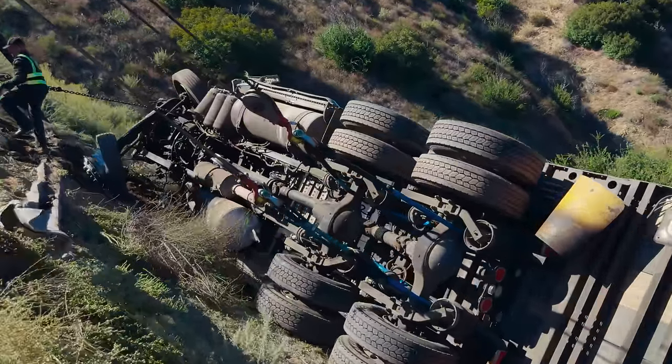So what you're gonna do, since you're fully boomed in, is I'm gonna extend out the boom all the way. Can you extend it out? All the way. See, the thing is, because your boom is fully retracted, your line of action, you don't have a rotator, it's gonna fight you here. It should help a lot.